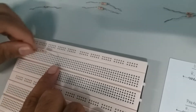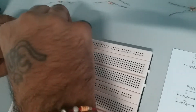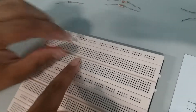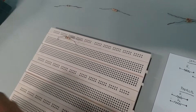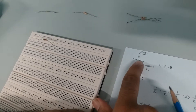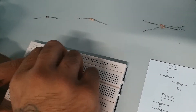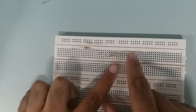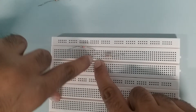I'm taking the 1k resistor and plugging it in. This is node 1 and this is node 2. Now I take the 2k — as per the diagram, the node at R2 meets R1 here. This is the series connection: it goes from one node, through a resistor, and they meet at the same line of the breadboard.